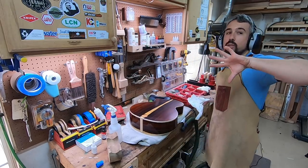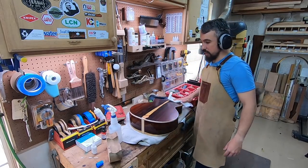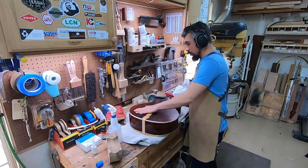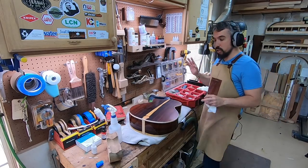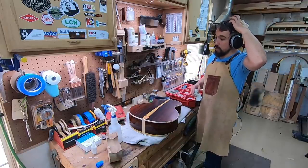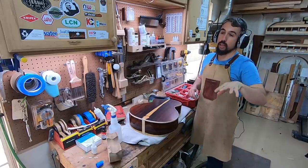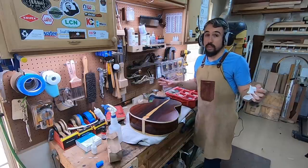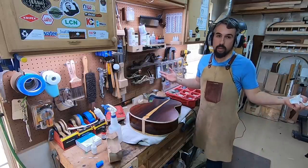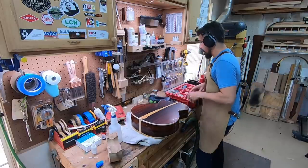Even without time-lapse, Matt and I have been at this 16 minutes and I could take this to the buffing wheel now if I wanted to go straight to the coarse. But if you have a good sander and you've done a good job on your lacquer spraying and gotten the surface super flat, you'll save a bunch of time here. Like I say in the Pore Filling and finish prep video — you're going to have to spend the time somewhere. Because I spent the time on the prepping end, it took me only 15 minutes to get this guitar ready for buffing.